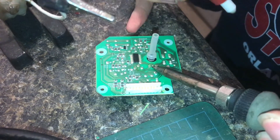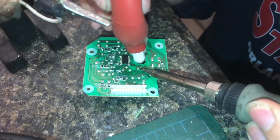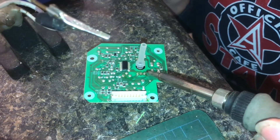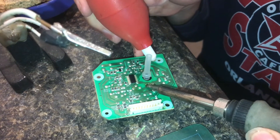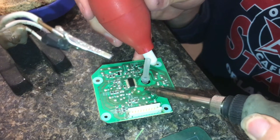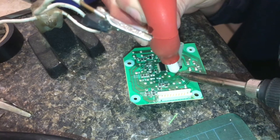The reason why I sometimes add extra solder is because it allows the heat to transfer a little quicker. Wow, that looks great. Since it's a liquid it can sort of just lay between the iron and the target solder — it's a little bit better. But it'll melt eventually.